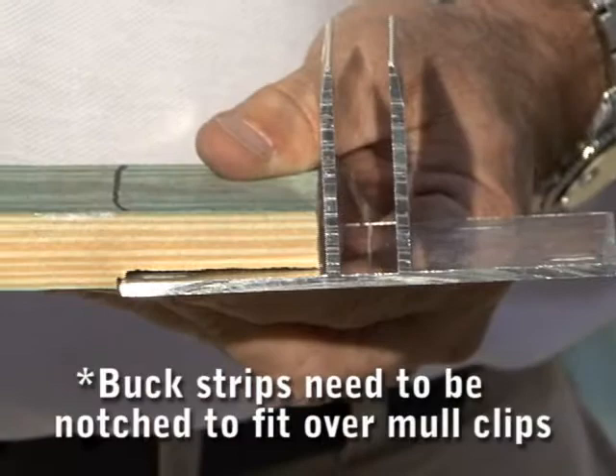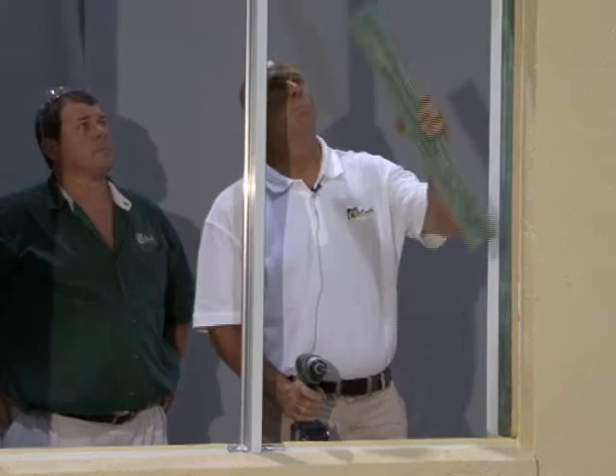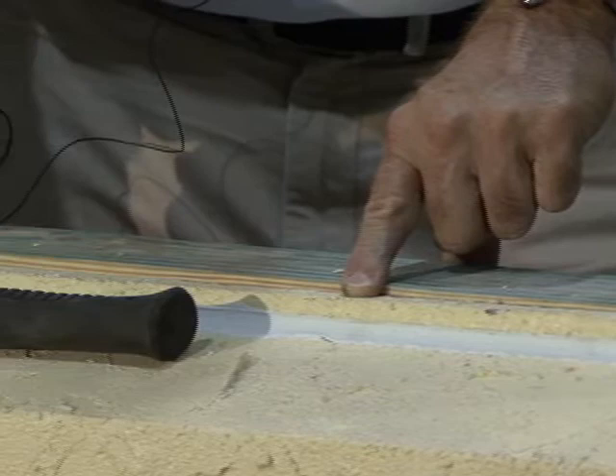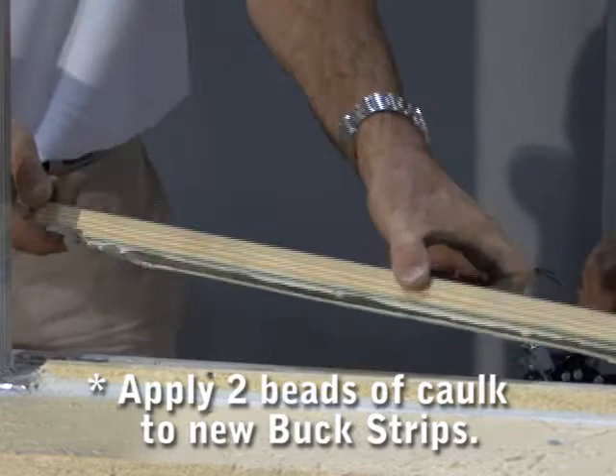The plate is caulked and the mull is caulked. As per our mulling instructions, the mull clips — the wood goes over the mull clips, so the wood must be notched on the bottom or top to go over the mull clip. When you install your buck in the head, it will go over and cover your mull clip. We're also installing the buck on the bottom on the precast sill to level the top of the lip on the sill, so it supports the weight of the PVC window — all three inches of it. Like the top and sides, the buck strip needs two rows of caulking to keep out any water penetration.